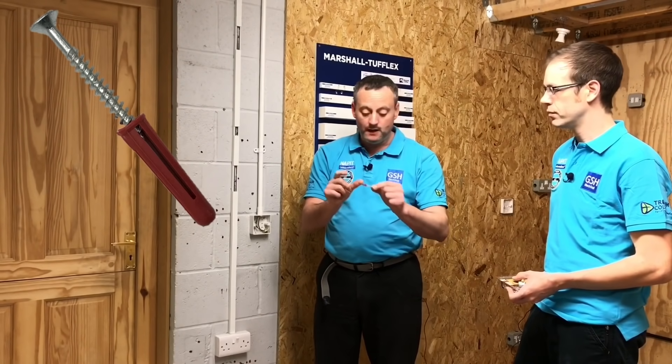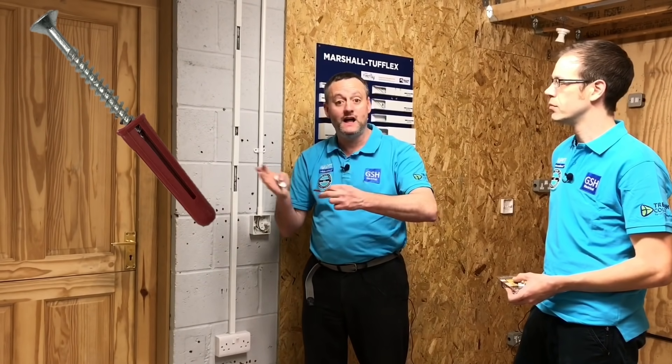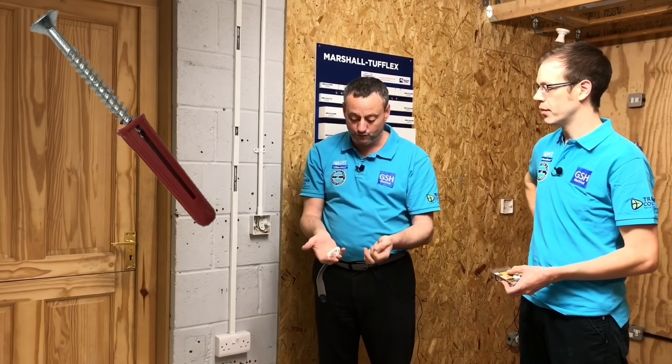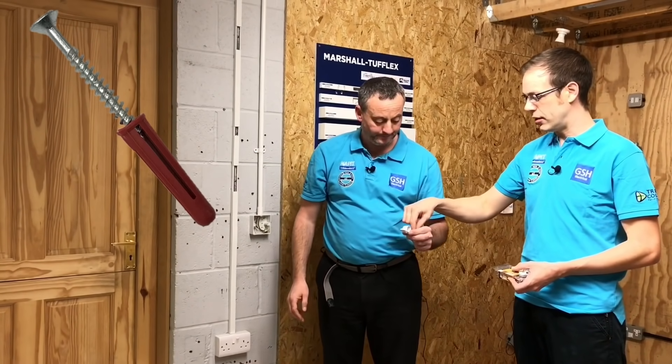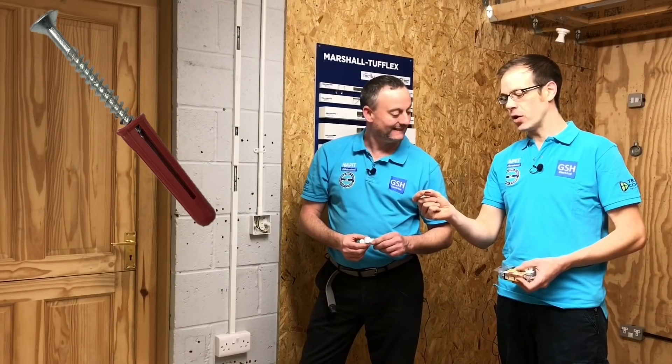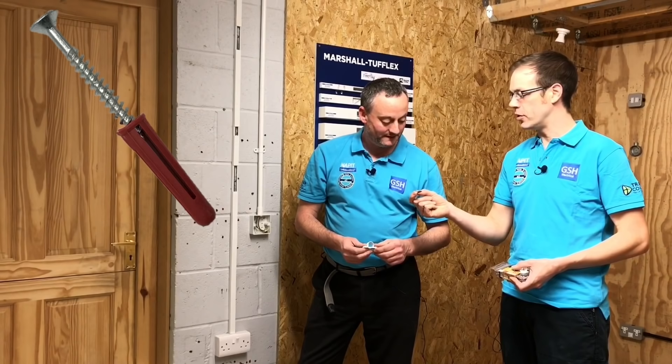We covered that in the previous video. However, the concern is that with premature collapsing, heat transfer through a fire could cause a plastic plug to pull out of the surface. Although it's mildly inconclusive, industry is going with no plastic plug. Behind each of these metallic saddles I've actually used a plastic wall plug and screw to hold them in place. It's fair to say you've got to weigh up your own conscience — for the sake of a slightly more expensive screw, I'd probably go with just a metal screw and no plastic.